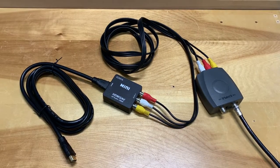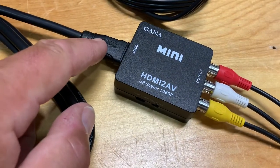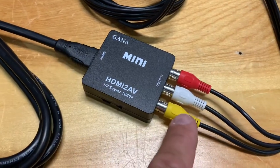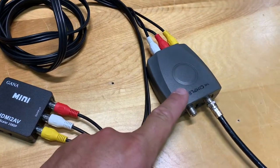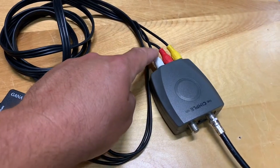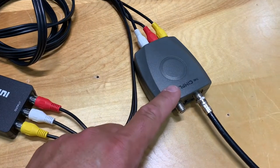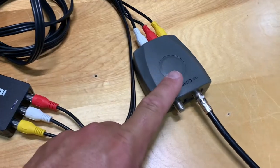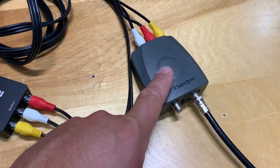Here's a model of the basic setup, starting at the converter. Your HDMI source gets plugged in here — this could be a Blu-ray player, a laptop, or a streaming device. Your RCA output goes into some kind of modulator. If you didn't want to use coax, you could plug this directly into an older TV with RCA inputs. But if you want to feed this to coax — for a TV without RCA inputs or to make it part of a home-run cable system — then you need some kind of modulator.